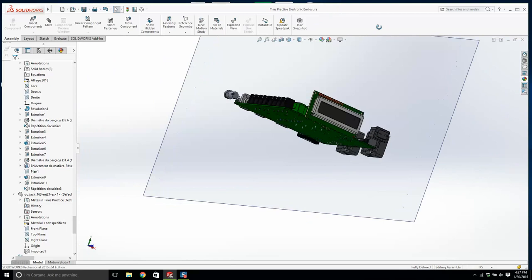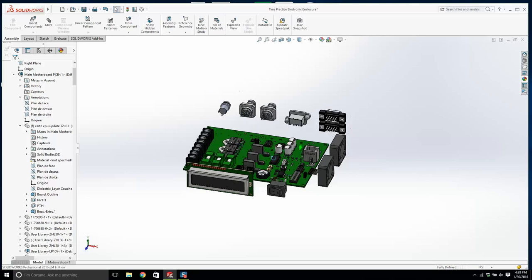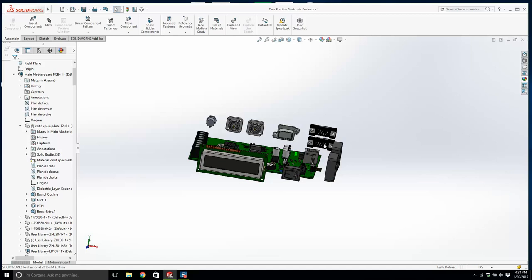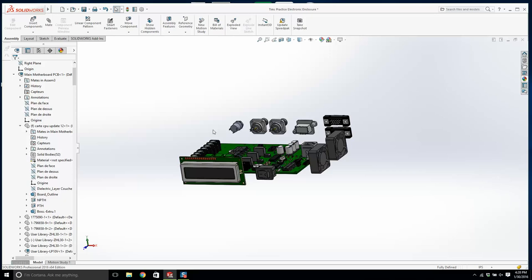We're going to use a sheet metal design. I'm going to use some punch outs. We're going to use a sheet metal box that will just go around. It'll have a base flange. I'm going to try and use a miter flange. It's going to have four bends, and then we would weld the corners. I think that's what we will do, and then we will bend the top, and that'll be that.